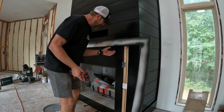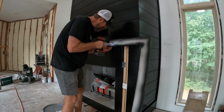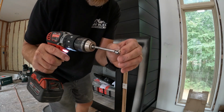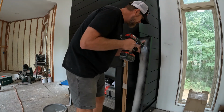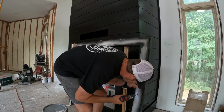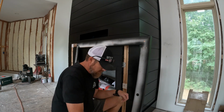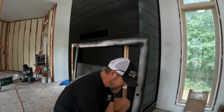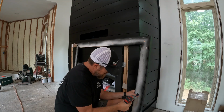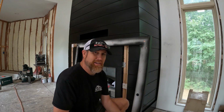So on the back side of the surround, I have a 1/16 inch hole, and then I can just take the pointy part of the Forstner bit. I'm just going the depth of the bit itself, which is about 3/8 of an inch. Now that I have my holes recessed in there, I'm just going to take the male part, using a number 4 by 1/2 inch long, just a standard screw. Just make sure your screws aren't longer than the thickness of your surround, because it'll poke through.